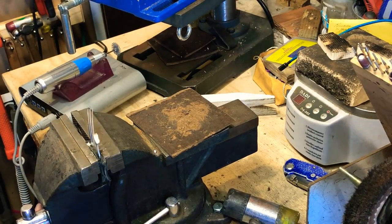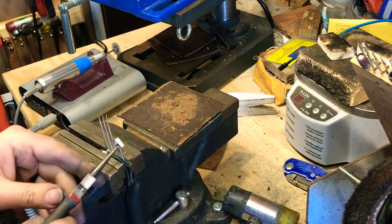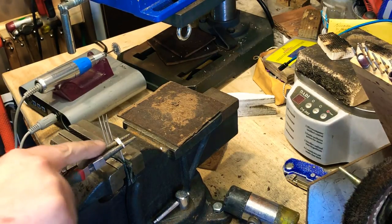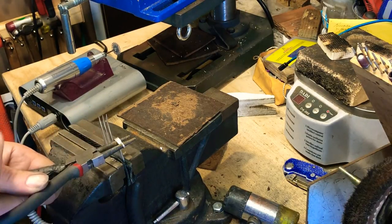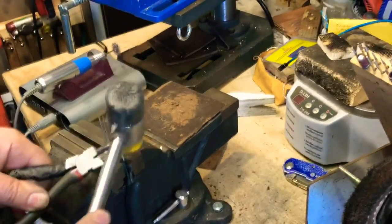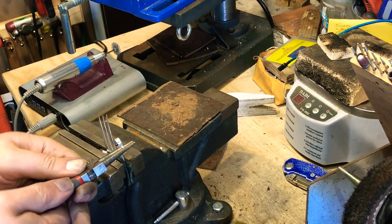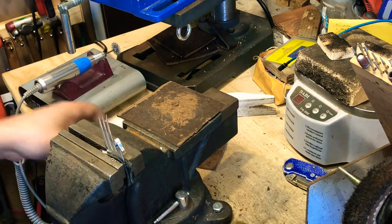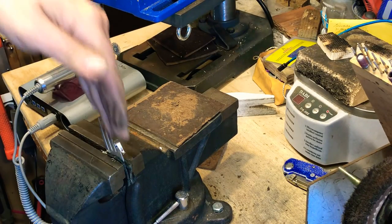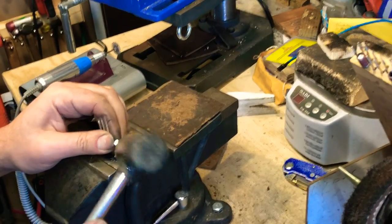Again it's not flat so I'm going to hammer it. This time we're going to take and run this piece down. So I've got a pretty thick piece of my pliers here — that's going to give me enough roundness to not give me that hard edge. And I'm going to lightly bend it over. Then I can take my tip and slowly round it around. And then I'm going to tap it straight down — that's going to give me a little bit more of that trunk coming up. And then we'll give that a little tap to close it up.